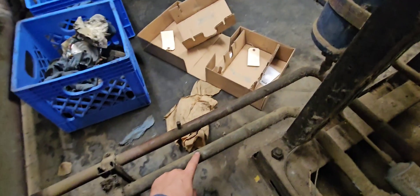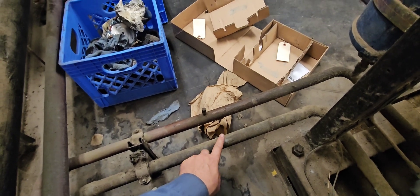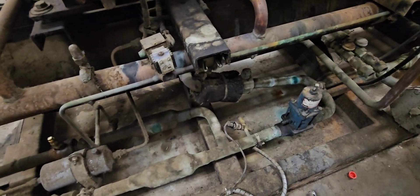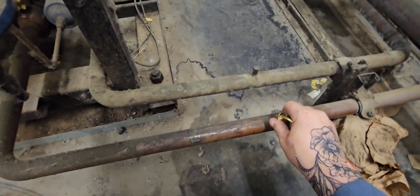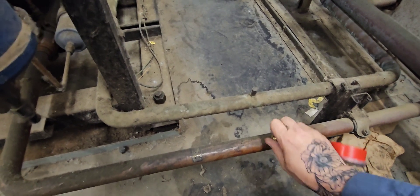It's going to be super easy — we've got four valves to shut off. The main thing to remember is to put a high side gauge over here and monitor your head pressure while you're doing this. Make sure that head pressure is not climbing too high. We're using full condensers since we're in summer, so both of these drop legs are going to be active.